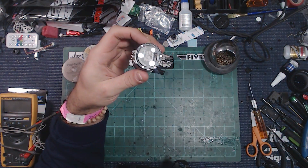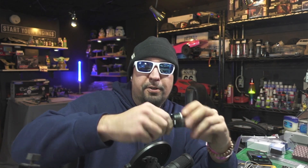If you have tabs like this, don't just lay the motor wire on there and heat the whole thing up like crazy, because the solder will pull down and bridge your motor. If you solder a new motor and it's not spinning correctly, check that you haven't bridged two of the poles together. If you've bridged two poles, the motor won't even spin in your hand — that's just how the magnets work inside.